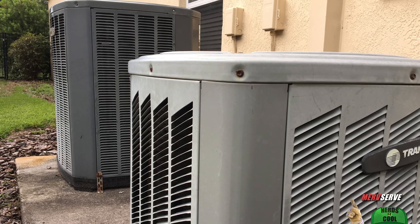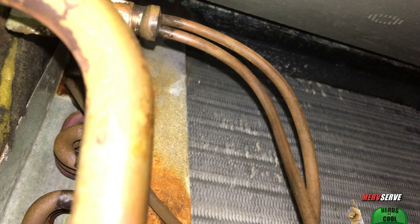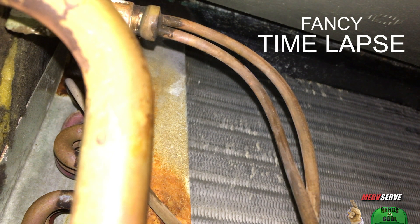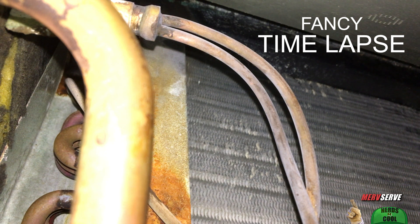After a quick look outside, I went straight to Margie's inside unit. Watch these pipes behind the panel of her air handler. You see what happens when the air conditioner cycles on? The lines are freezing over. You see how they're turning light? Now this may seem ironic, but if your lines are freezing over, most likely it's because your refrigerant is low, or maybe it's obstructed and not flowing through the system right. It seems backwards, but it's true.